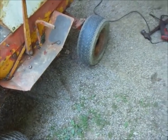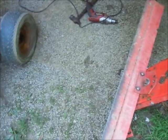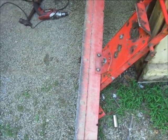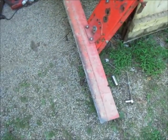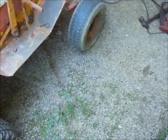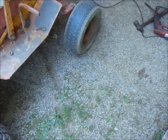So, I'm going to stick this back underneath here, pick it up, angle it side to side, see how it hits. If I got to take these lock bolts back out, I got to take them back out, you know, it's whatever. I put them in there because that way I could put down pressure on it and the A-frame wouldn't pivot down. But if that's what I need to do for it to angle and actually sit on the ground level, then guess what? That's what I'm going to have to do. So, alright. I think I'm going to stick my lock bolt back in it just so it doesn't swing around and pinch my fingers or something. I'm going to stick it back on here and see if it'll hit level with an angled, or if it's going to be like the tip side is going to be hitting way first, which might be okay if you're trying to cut a ditch or something.